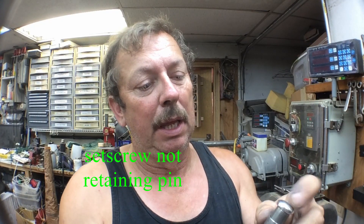I'm going to use a set screw on it. I'll go ahead and disassemble this before I sandblast it to powder coat the rest of the handle, and drill it to retain that set screw. I'm not going to drill into the cap yet because the rest of the handle will be powder-coated red, and I may very well anodize this translucent red — so we've got a bit of contrast, a slightly brighter knob right on top. Then it'll go in the CNC mill and I'll engrave '701', or possibly 'Zenith 701' — I'll run a couple of test pieces.